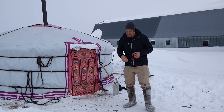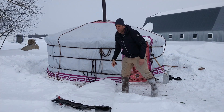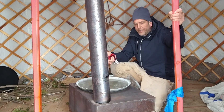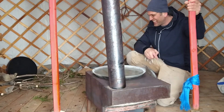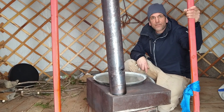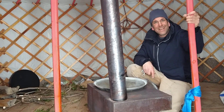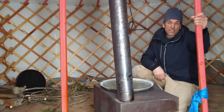Over the years we were using one type of house wrap. Last year we started trying another one, and this year we've made a test of different qualities of wraps on this little trellis wall here. What we did — I ask you to follow me — we boiled water over a few days when it was very cold, minus 24 Celsius, very cold in Fahrenheit as well. We boiled about 100 liters — 20 gallons at least — to see where this water was going and whether one of those house wraps would work better than the others.